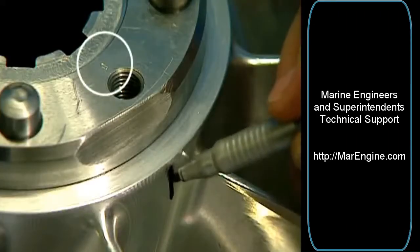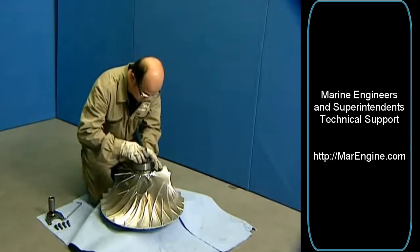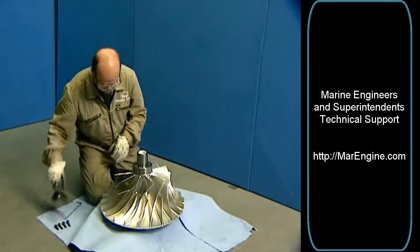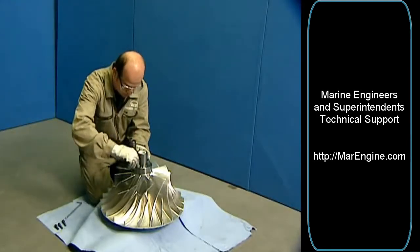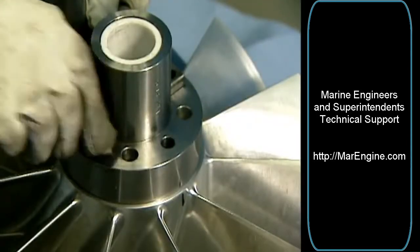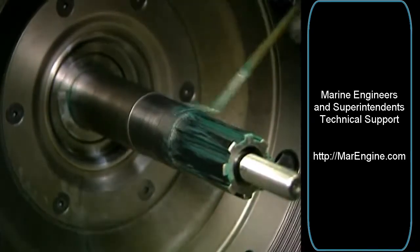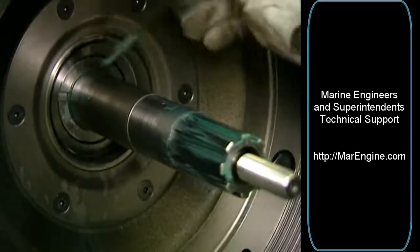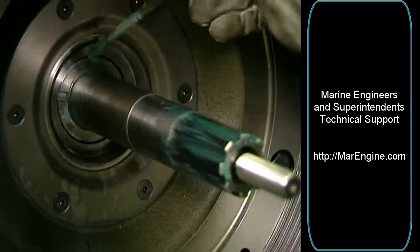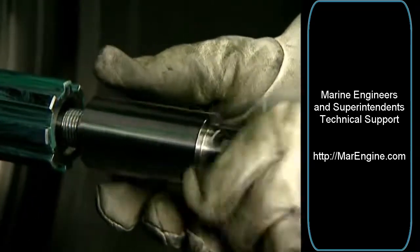Copy the balancing mark of the compressor wheel to its inlet surface. Mount the slide and the lever carrier on the compressor wheel. Lubricate the splined profile and the compressor wheel seats with Molykote P40 to protect against fretting. Screw the sleeve onto the tension rod of the turbine rotor.